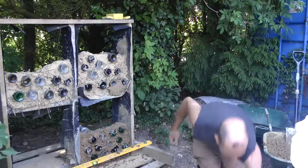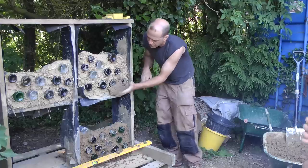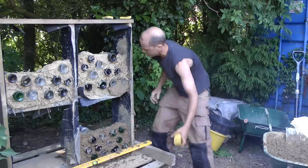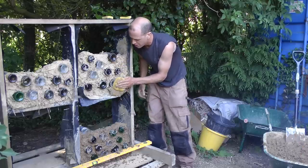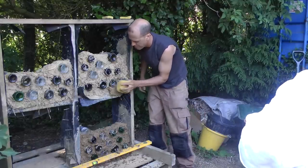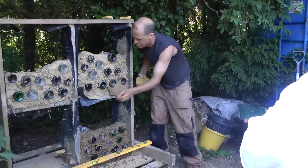The pointing material is the same mix as the wall but without straw. I work upward — I won't rub downwards because that pulls the mix away from the bottle. I'm not patting; I'm just pressing. This is what you want your wall to end up looking like — no straw and bits sticking out. If you see any bits of straw, just pull them out as you work.